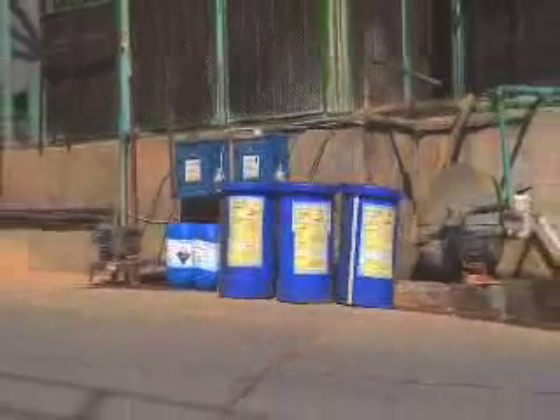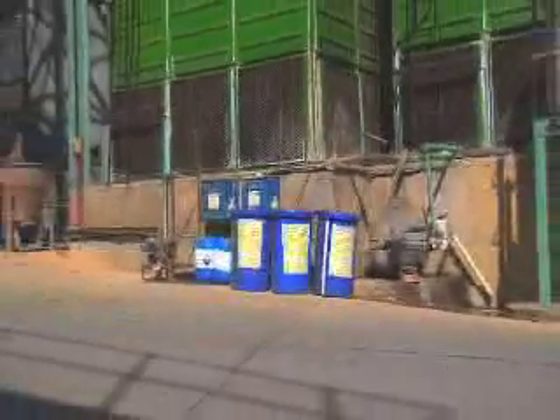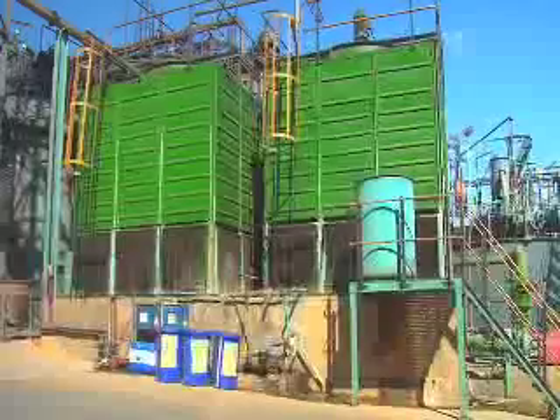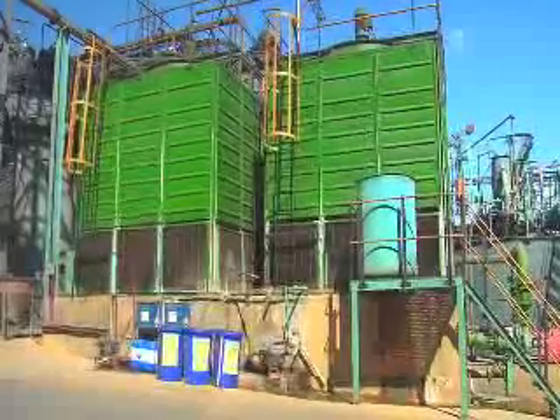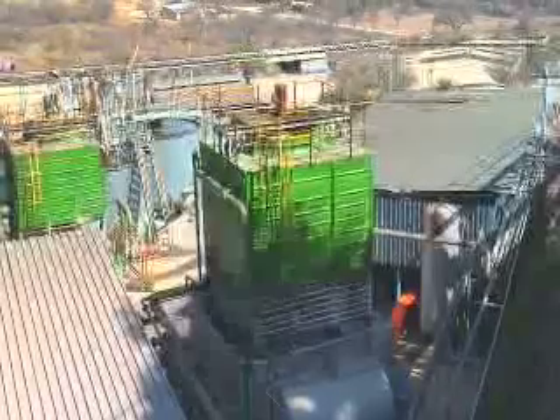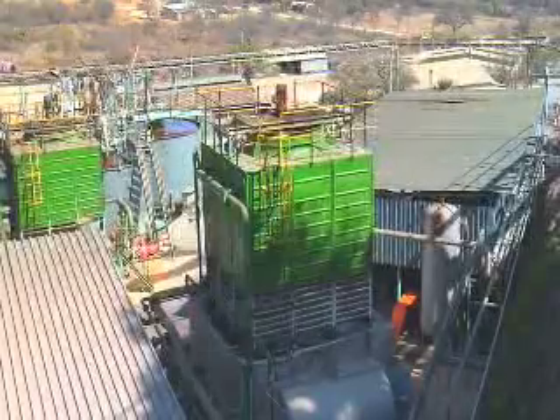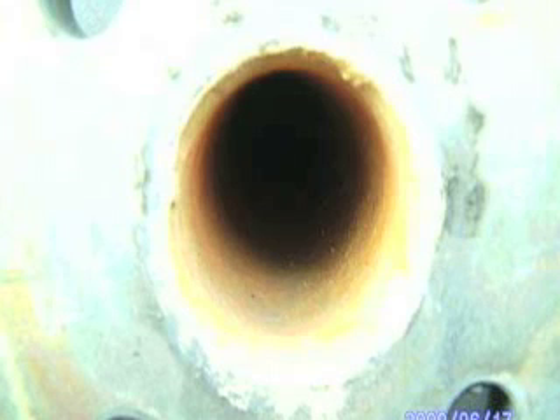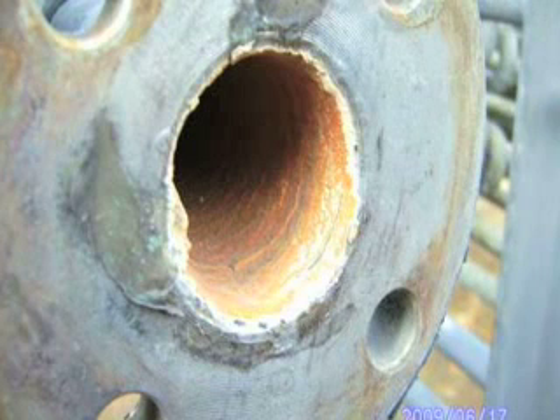In the past the mine had to improve heat transfer and remove all the scale build-up periodically. They had to fill a drum, lift it up to the tank, connect each of the cooling coils into the Savtox drum, and circulate the Savtox through the coils in order to remove all the scale. As things are now with the WESIS system, this will not be required anymore.